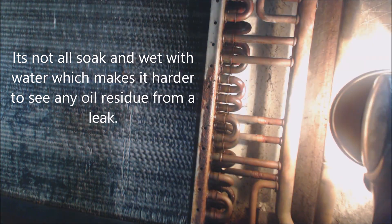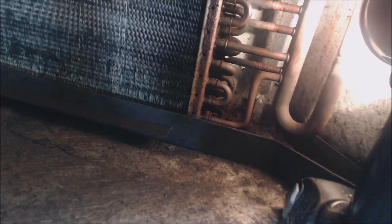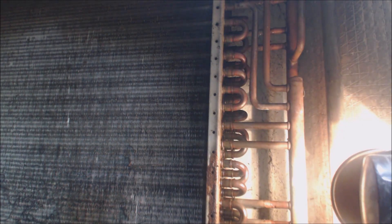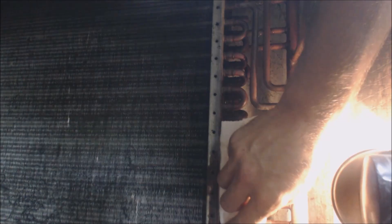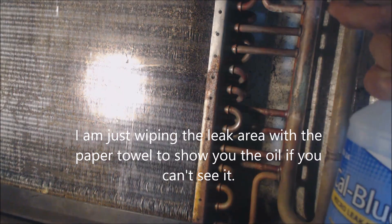The unit is a little low on refrigerant. Looking at the piping, it's not soaking wet. There are some oil stains right here and from here to about here. Down low there doesn't seem to be any oil — I touch right here and there's nothing, no residue. Coming up higher, no residue either. But coming in here, there is oil residue right there. So we're going to go ahead and spray these joints down with a leak detector.